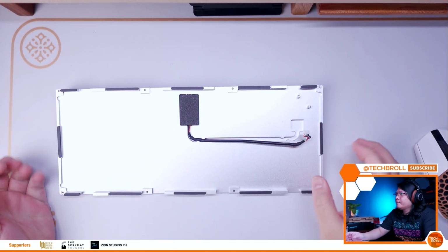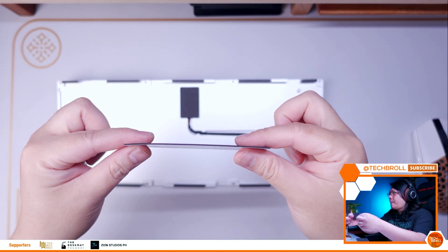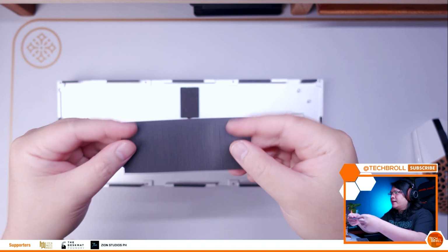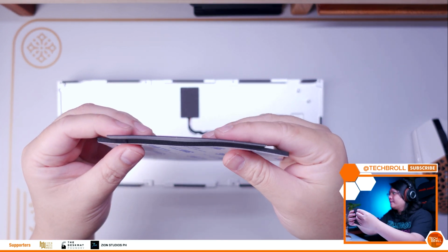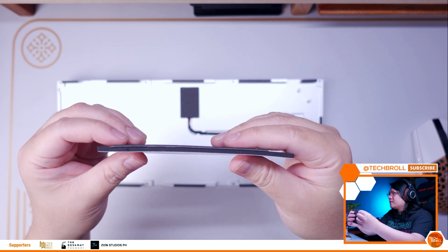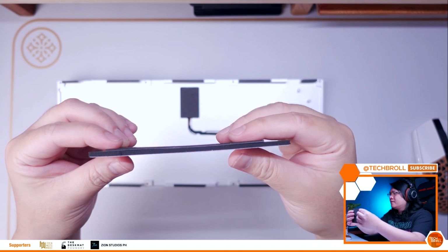The next step is to upgrade the gaskets around the bottom case, and like I said on the stock build video, some people prefer the triple gasket mod by simply adding a couple more of these extra gaskets with no extra cost. But for this build, I will use the thicker D65 gaskets from KBDFans so that I only need to add one more layer, which is in my opinion more stable and doesn't add an additional point of failure compared to the triple stacked gaskets.